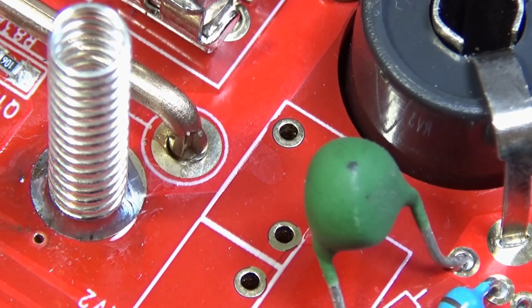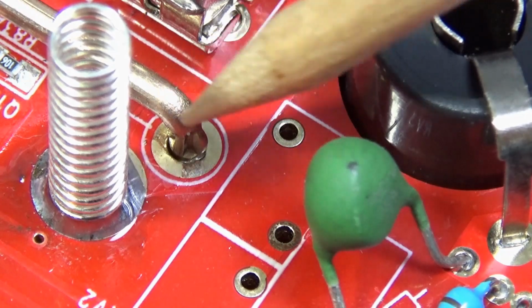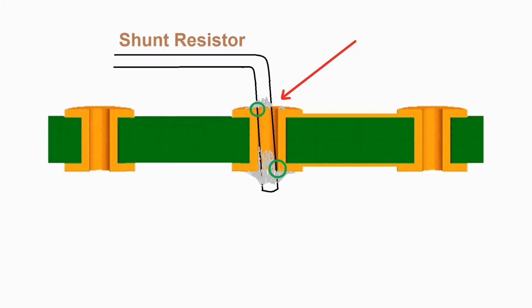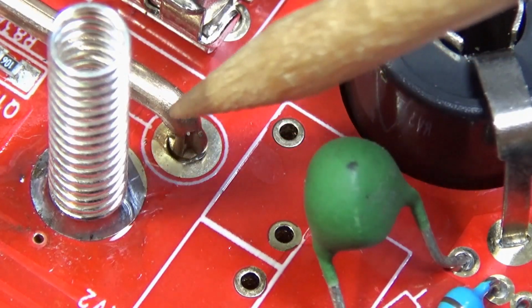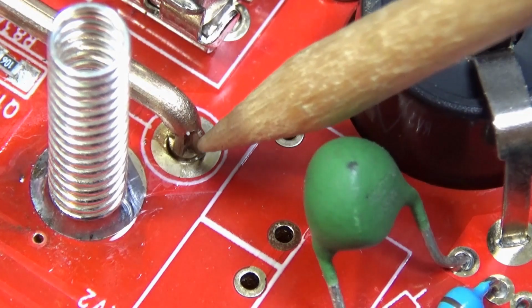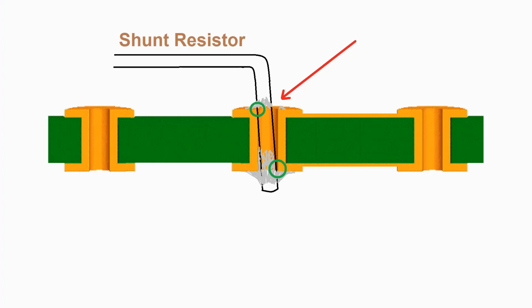But as a designer engineer or manufacturing engineer, what is important to me is to approach the maximum contact between this wire and the barrel wall. For me, that contact is important because, as I explained with the banana connector, I need this metal to touch the other without the solder getting in between. We are talking about a 0.005 ohm resistor. So the solder in between is already a resistance. So what I need is a better contact more than a good solder.